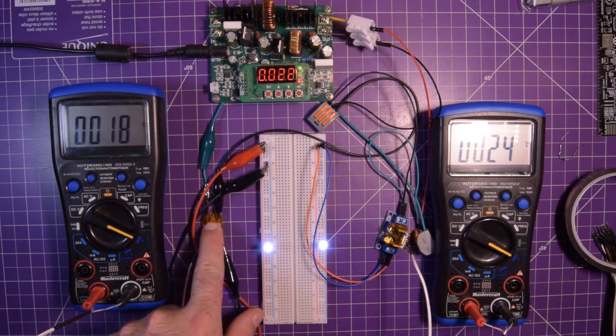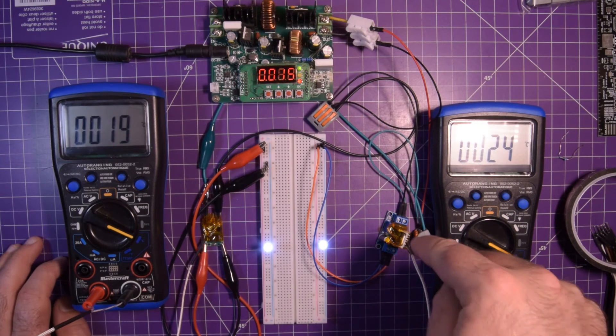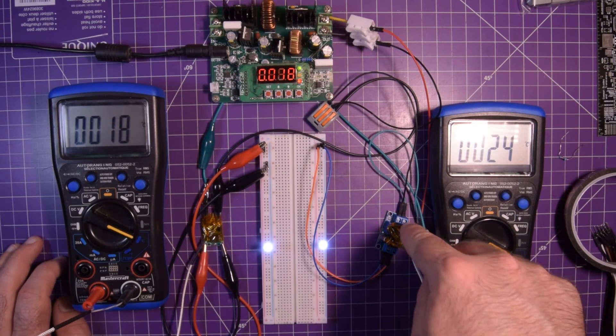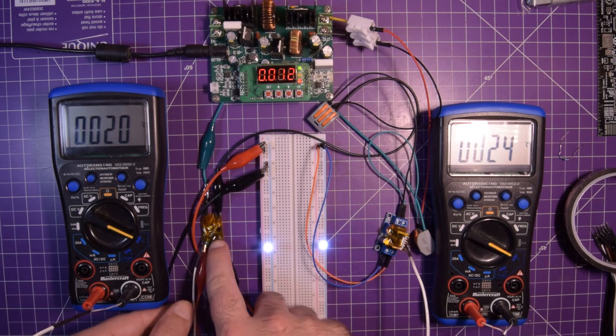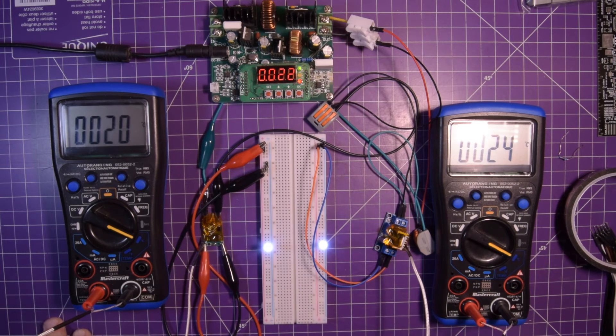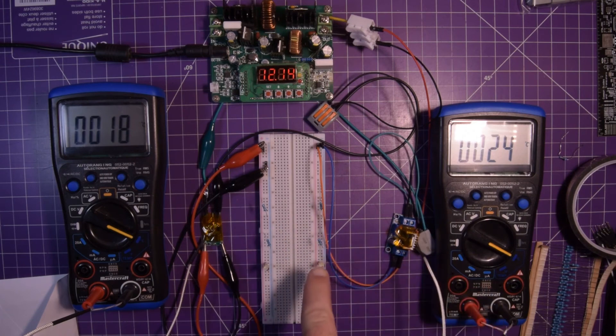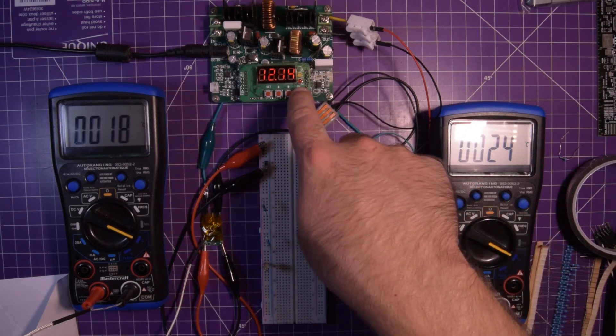One probe may have lifted off a bit — it is cold in the basement but not that cold. So far so good; this giant heatsink is dissipating a lot of heat. This guy here I'm not too happy with the contact. No trouble at this stage, so let's move up a little bit in the current. Now I have two 100-ohm resistors in parallel — so a 50-ohm load on each side plus the little LEDs. Let's power this up.